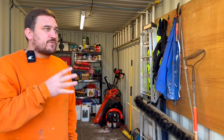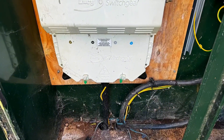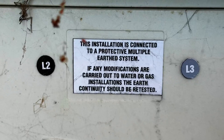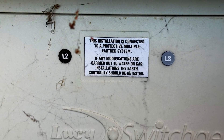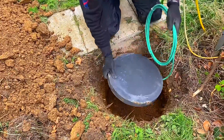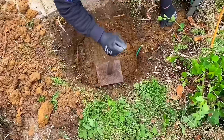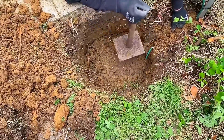Now what we have to look at as part of the EICR is what is the current earthing arrangement we have. In this installation we have PME, and then we have to look at can we export the PME to these. Now myself, if I was installing power to this, I would straight away be thinking earth stake, earth stake, or an earth disc — putting it on a TT, severing the earth from the PME, so this is its own potential to the greater mass of earth.